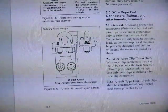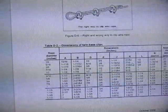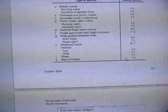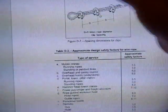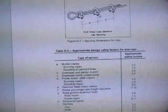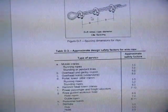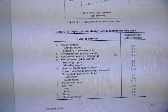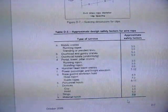It's also important how the rope is terminated. If you use U-bolt clips, they should be used in a very specific way — it matters how these clips are rotated and how big the loop is at the end. The spacing of the U-clips is also important. Just the wire itself doesn't tell you everything. Safety factors also apply: for a material hoist you might use a safety factor of seven — oversize and over-design it by a factor of seven. For mobile cranes, the safety factor is three and a half.